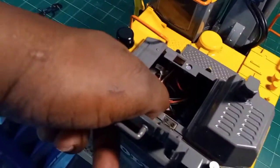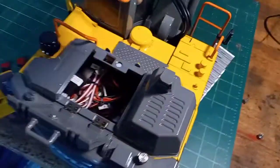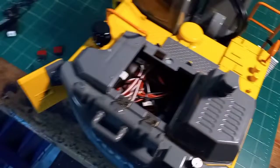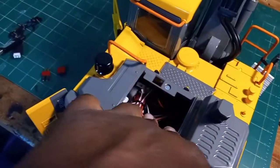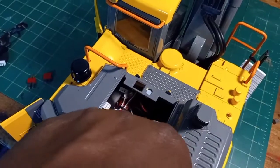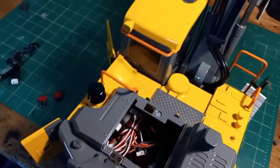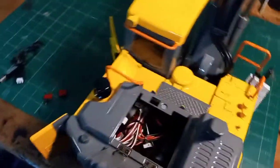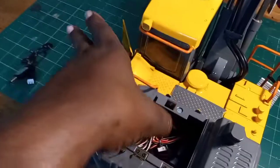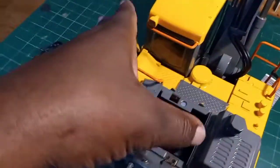And what they do is they control, besides the movement of the bucket, limit switches and all kinds of things like that. So they control that. And those are not labeled very well. So they have numbers like E5, E2, D6 or whatever. So unless you take each of them off individually, run the excavator and see what's not working right, you would never know.